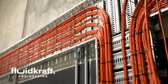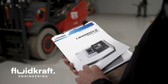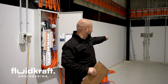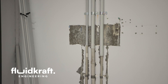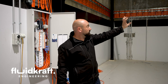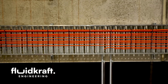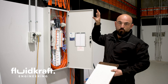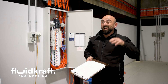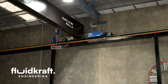Part of running a manufacturing facility is you need power to run things. We need 200 amps coming in, which should give us enough to run our CNC machine and our plasma cutter. We had to upgrade the board — you can see that shadow piece on the wall that hasn't been painted, that was our old board. We've extended the cables up into the cable tray — a 450mm wide cable tray that wraps around the whole building. We had to factor in the columns running around the place, and we can't drop power down from the centre since we have the crane.